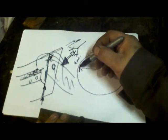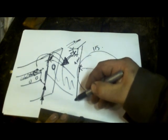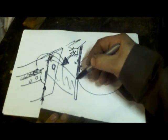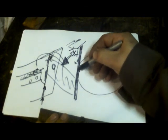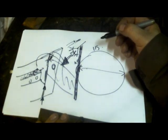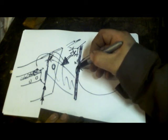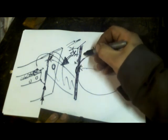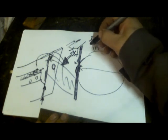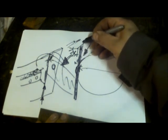But when your actual disc is working on the steel, there's the actual cut. That's the sort of thing you want. It's gone through, and it's a bit out the other side. Your eye is here, not as close, just general direction, and you're cutting your line as you go up through the steel.